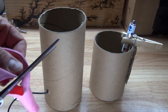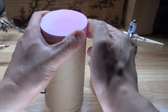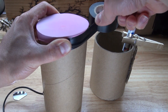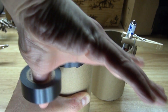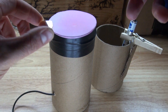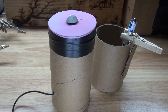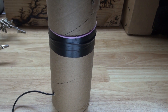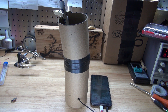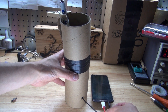Cut off the balloon just like this, stretch it out, and place it over the tube. Get electrical tape and tape the balloon down. Using the balloon method works a lot better because the speaker will make the balloon vibrate better, which will make the laser light show look much cleaner. Put hot glue at the very center of the balloon, take the reflective piece and place it on top of the glue. Now put the top piece on top, making sure the laser is aligned to shine onto the reflective piece, and tape it in. It's at a slight angle because that's how I got the laser to work.